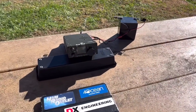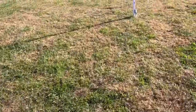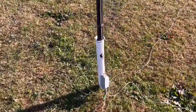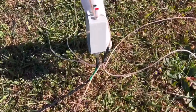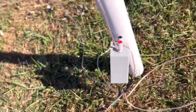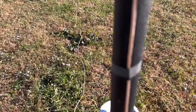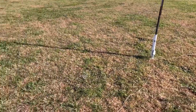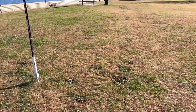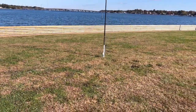The antenna is up — I'm using the G90 with a 6 amp-hour LiPo battery. Here's the construction: coax going out to the 4-to-1 transformer. I've got 5 counterpoise wires. What I do is twist them all together, take a short piece about 4 inches or 100 millimeters, bundle them, and connect that to the ground side. It's not pretty, but it works. I use electrical tape along the pole to secure it. The counterpoise wires are all over five meters — not cut to any specific length.